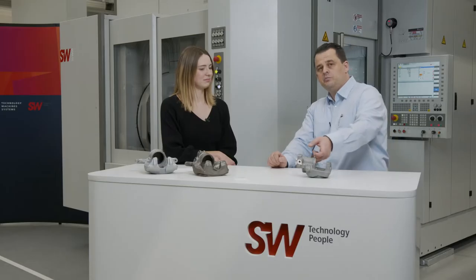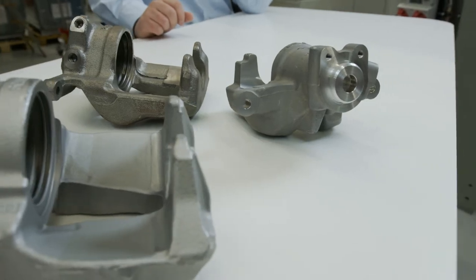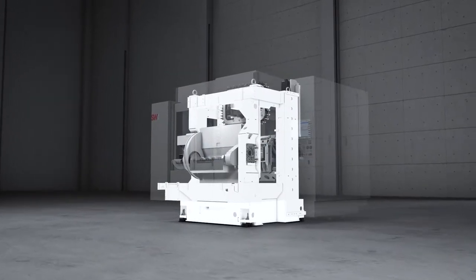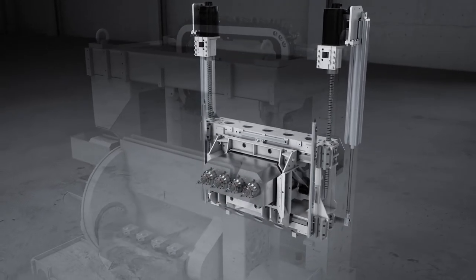We have here an aluminum part, therefore we can use the W0442. It has linear motors, a 3x unit and a mono block which guarantees high stiffness. The 3x unit is high dynamic. We're able to do a tool change within 2.4 seconds for all four tools. That's the right machine to choose for this part, as long as it is not cast iron, because the linear motors would not accommodate that really well. But we have the ball screw for that as well, so whatever your part consists of, we will find the right solution for you.